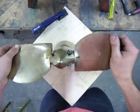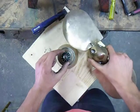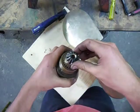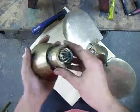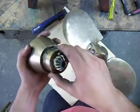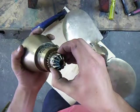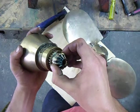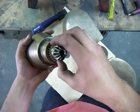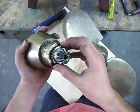While you do it, just put a little bit of pressure on the blades, on the gear like that, so that this gear here doesn't pop out and then you've lost what pitch you had. Once you've got it out, you have to have a look at where that pinion is positioned on the hub. The single dot on the pinion is the datum for right-hand, so it might be 2 clockwise or 4 clockwise, or 2 anti-clockwise or 4 anti-clockwise. Anti-clockwise from the datum on the hub is minus pitch; clockwise from the datum on the hub is plus pitch.